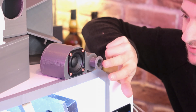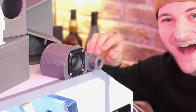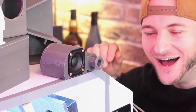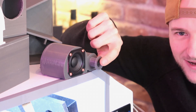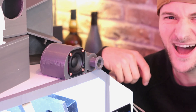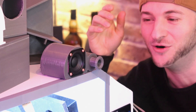The graph looks good, but I think the first thing I want to do is listen to it outside of the cabin just to see if there's any insane port noise going from this kind of thinner tube at the back expanding and then thinner again on the front. 25 scaled hertz is going to give us the most port displacement. Let's just see if it's really noisy or not. Oh, it has a weird resonance to it... it sounds horrendous. Listen to how it changes when I cover slightly the port. It's like you've got something in your mouth. Oh my God, it's horrendously noisy. It is like a hurricane of chuffing sound.